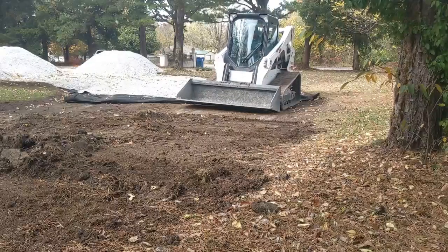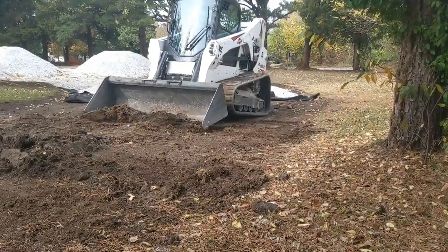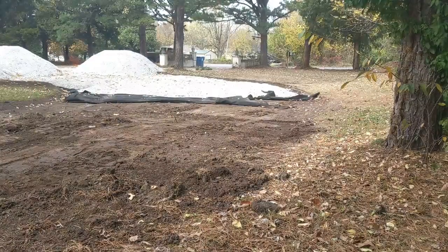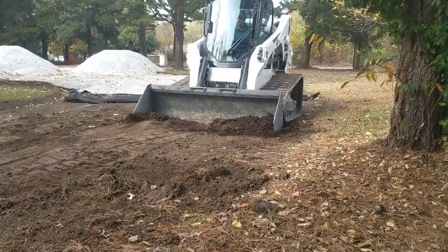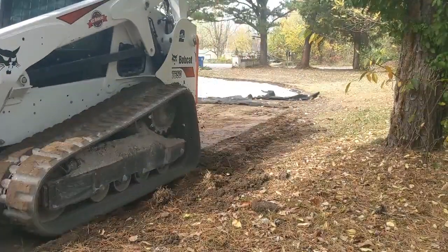If I've done my math correctly, 60 tons of rock is approximately 40 cubic yards of material. 40 yards into 1,500 square feet is an average of 9-inch depth. Now I know I may have gone a little deeper and applied a little heavy, but I don't think I've gone 9 inches everywhere. For those that have installed driveways before, leave a comment and let me know. Did I apply too much rock?